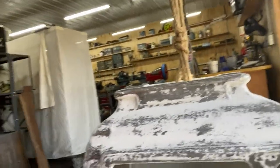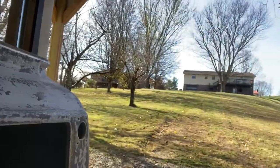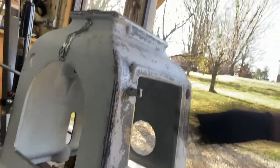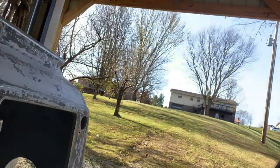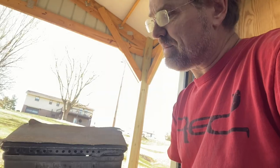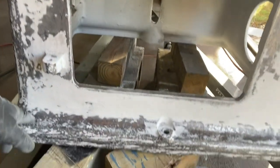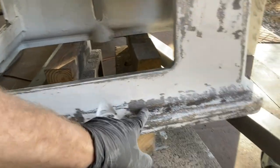So then I decided I would go after it with a rotary sander like this. That's good at taking off material, but it tends to make lines because of the curvature where it touches the most. So then I was using this power orbital sander, which is so-so. It doesn't seem to remove as much material, though it's better, I think, because it's a wider area. So every place here that there is still material is still a low spot.